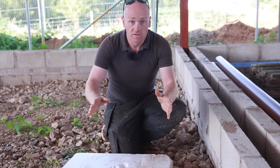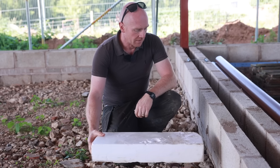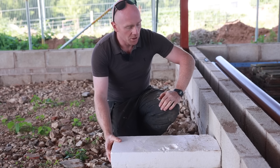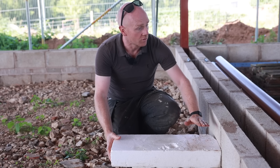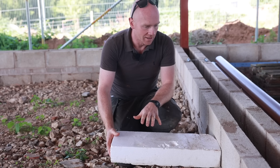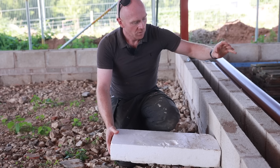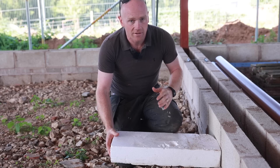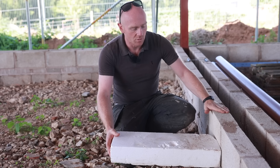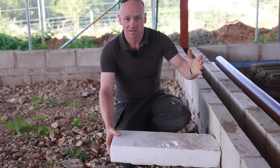Our floor insulation is going to be 150mm PIR but for demonstration we'll use this bit of polystyrene. That's going to bring us up — by the time we've got some type 1 sand blinding and the insulation we're going to be about 150mm off the top of here, with our reinforced concrete slab going on. So we could have a really high performing floor insulation, we could have the best passive standard wall insulation, but we've still got this cold block to worry about. Unless we could have an insulated slab foundation — which we can't do on this building — there is no way that this insulation layer can go through the wall and join our wall insulation.